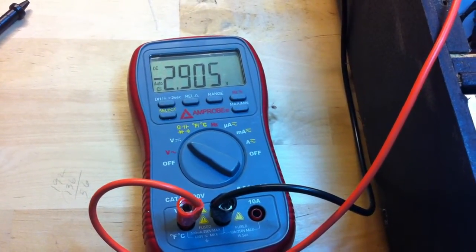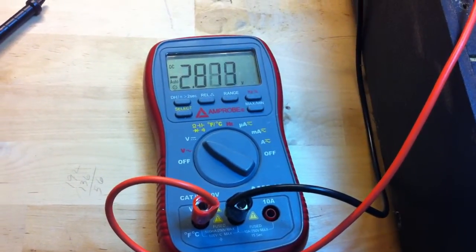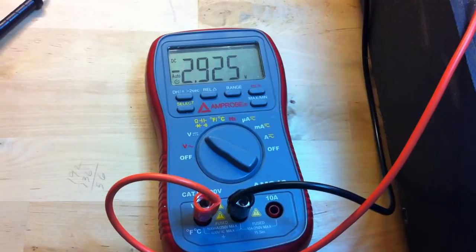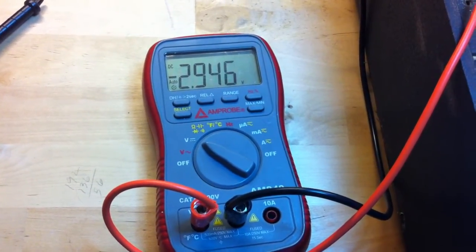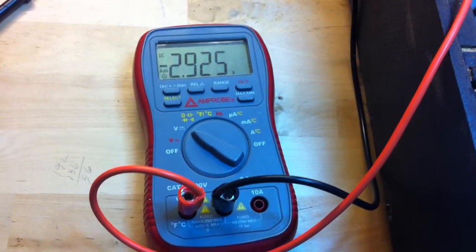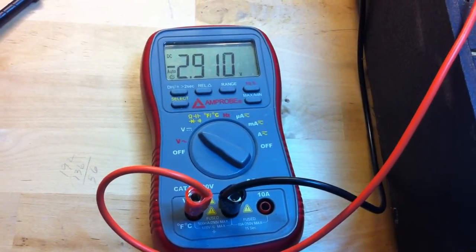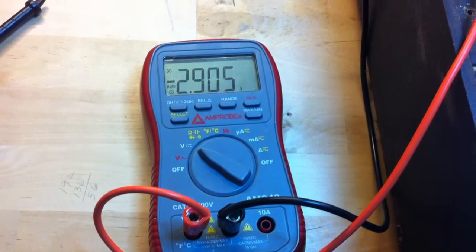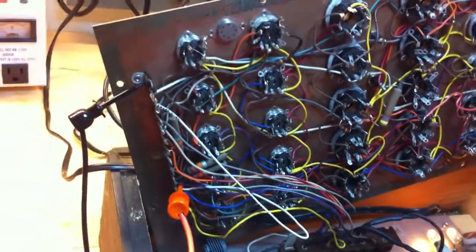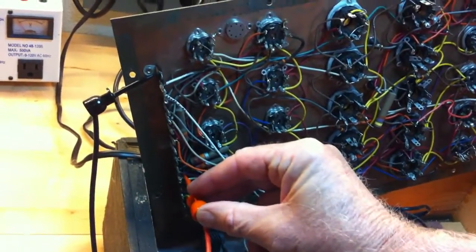Making turns, at one end of the scale we've got probably around 2.80 and at the other end we're up to probably 2.95 or better, so somewhere in the middle there we'll get ourselves a 2.90 adjustment — close enough. Going up the resistor chain, there's a voltage divider network here.